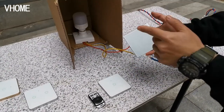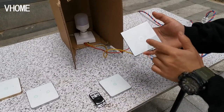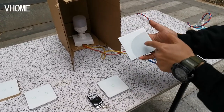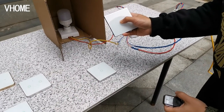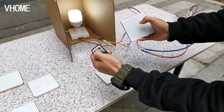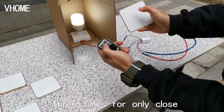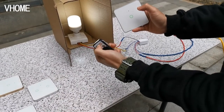This receiver has a new design for this function. We also need to learn another function: if the lamp flashes three times, it means the remote is programmed for OFF only — not for ON. We use this function to test it. Press it one time, two times, three times. You can see it is only for close; it cannot open. The open remote is only for open, and this one is only for close.